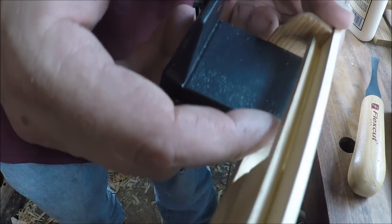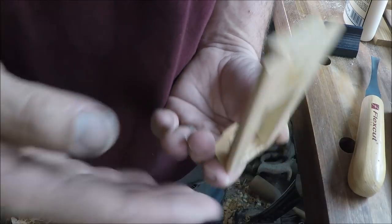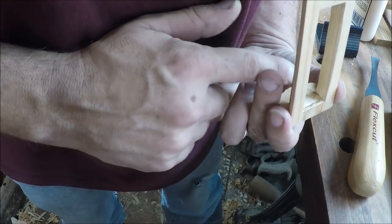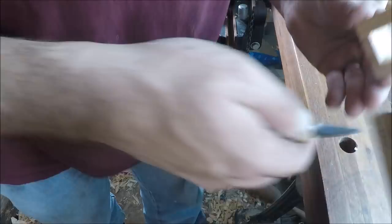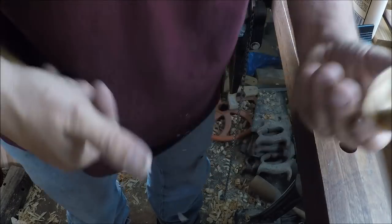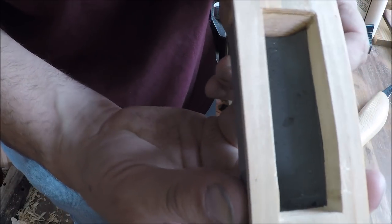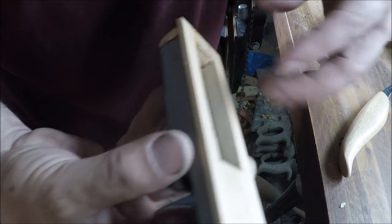Let me put a straight edge on it and have a look — we're tapering pretty nicely. This is a weird shape; it needs to be scooped out almost like a cone, a little bit wider radius here than down there, though these are all really small numbers. The light is terrible but hopefully you can see it's all blending in pretty well at the right angle, so the little sand core left in here won't get damaged as we pull the pattern out of the mold.